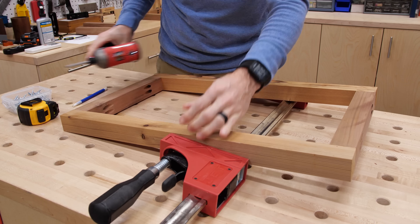Now it was time to go outside and try my hand at Shou Sugi Ban. I'm using a Map Pro gas torch, but a propane burner like what you use for soldering works fine too — or if you want to go all mad max on it, use a weed burner torch. I used some scrap cedar to try a few different techniques, from lightly burning it to charring it really well. I tried two different scrapers: a hard nylon brush and a hard wire brush. The wire brush is really aggressive, so I preferred the nylon bristle look with a good char. It's a great idea to test on scrap before you jump in.